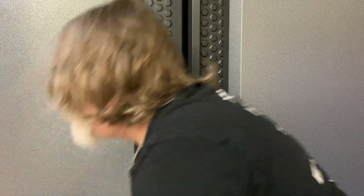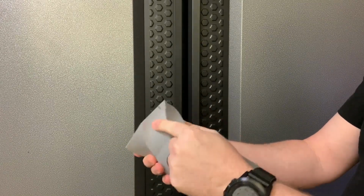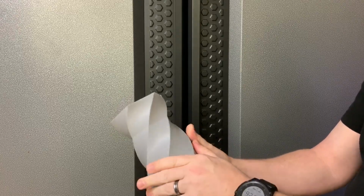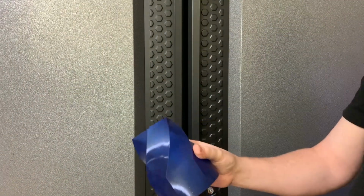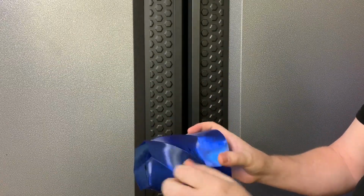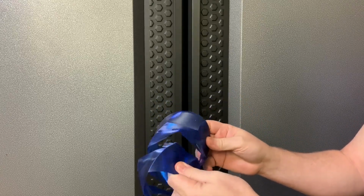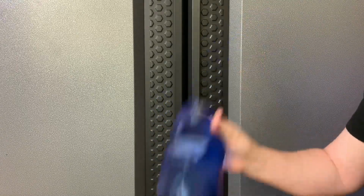So, let's once again look at the PETG. This is PETG in double wide vase mode. Oh, we did get it to break. Check that out. We got it to break. But for the most part, it's tough at double wide. And then here is the beautiful part of the single wide vase mode. You fall into this, you just knock it over. It's not brittle, it's not hard, it's flexible, and less chance of you, your loved ones, your pets getting hurt. So anyhow, let's jump into the slicers and see how we did all this.